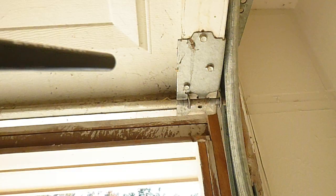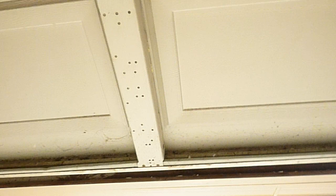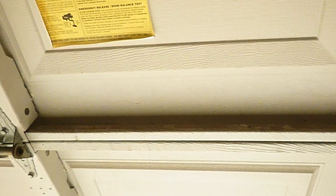The optic sensors are low enough but the wires should have been sealed. There should be spring tension pinch safety notices on each bottom corner of the door and there are not. There should be a pull handle inside the door, preferably in the center, and on the exterior as well — there are no pull handles. There are also no child safety notices posted on this door — wait, there is a safety notice right there, that's a good thing.